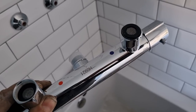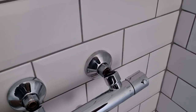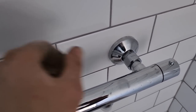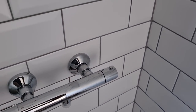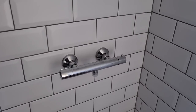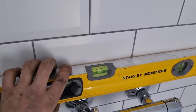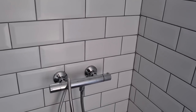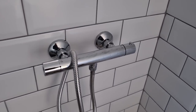Put your two washers in - it should just be a case of lining that up and tightening it up. It's obviously lining up perfectly because we've got our first fix pipe on this bit. It's just a case of tightening them by hand and then nipping them with an adjustable spanner - you don't want to scratch the chrome. Just got the riser rail to do, which will come straight in the middle, and then the bath screen. Nice and easy these. I wouldn't fetch the level just to double check, but it's absolutely perfect. Sometimes it's better to eye it with the tile - as long as it looks right, it should be all right.